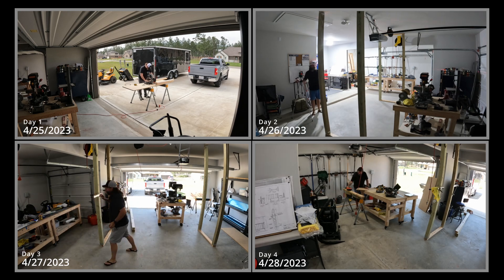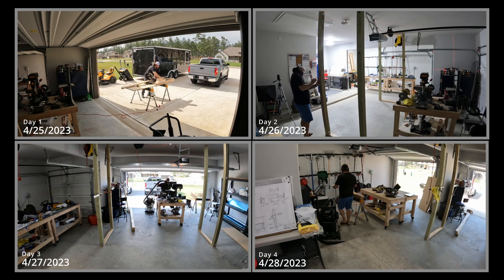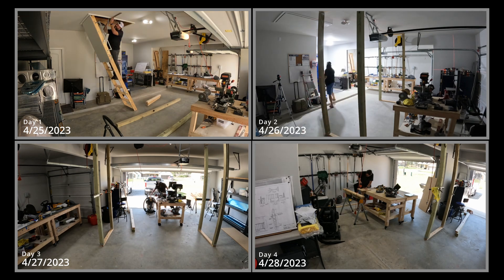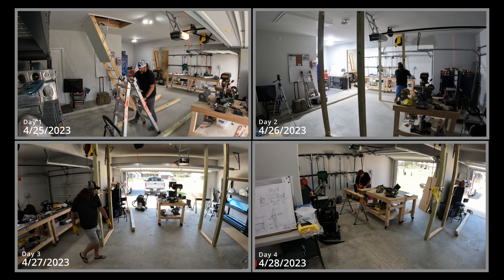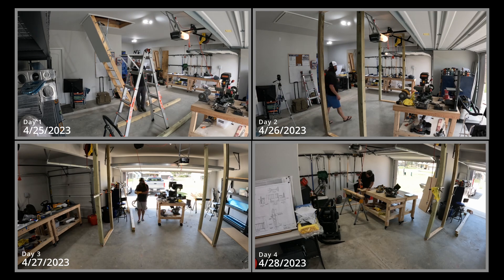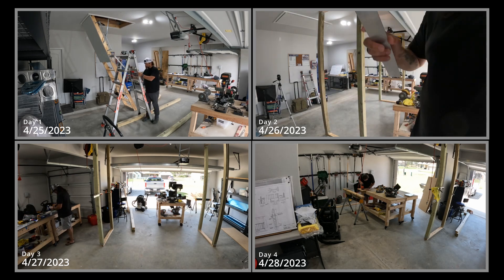I made a two-by-four footer using a four-by-four post cap to tie it in, and I didn't drill into my floor — I simply used liquid nails or a version of construction adhesive. That's not going to move. Same thing up on top with headers, then drilled into the ceiling joists, so that thing is dead solid. It took me a long time — a lot of head scratching figuring out how I wanted to do it. This is ultimately not the final configuration of the workshop.